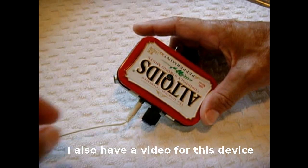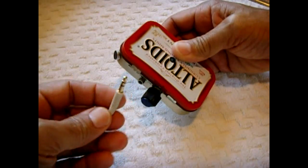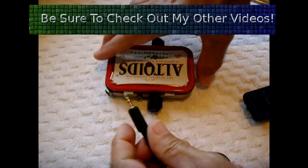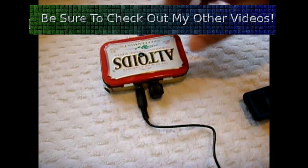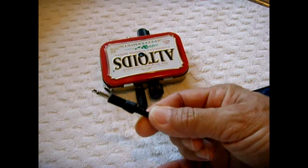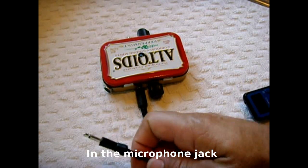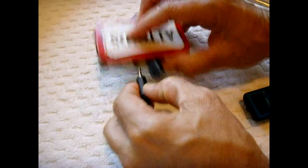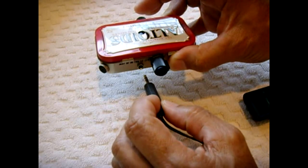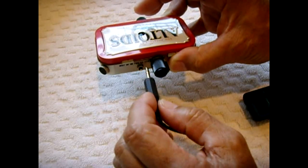What I wanted to do is be able to record what I'm hearing. There are two ways to do it: I could unplug the jack going out and plug this cable's stereo end directly in, then plug it into a digital audio recorder or my laptop. I could also listen and record at the same time by installing a splitter, which converts the one jack into two female jacks.